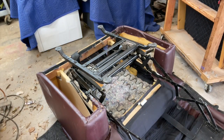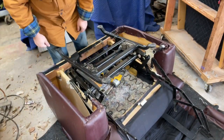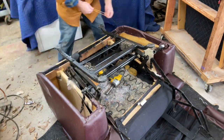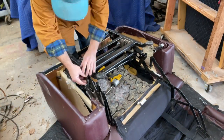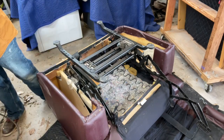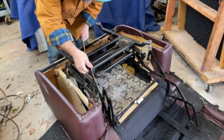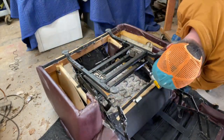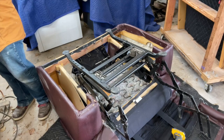To remove the mechanism, there are typically three, four, or five screws holding the mechanism into the wooden seat frame of your recliner. Once you loosen those up, you also have about four bolts or so holding your scissor spring into the foot rest. Once you free all that up, that should free your mechanism completely. You don't always have to remove the mechanism to replace the drive tube, but I have a couple of springs to replace so I'm going ahead and removing mine. Learn from my mistake — take pictures of how everything is attached, because the slightest misattachment later will come back to haunt you.